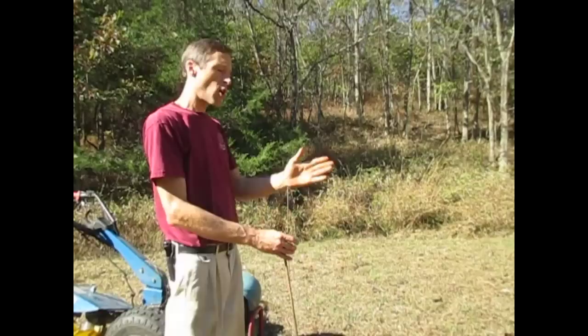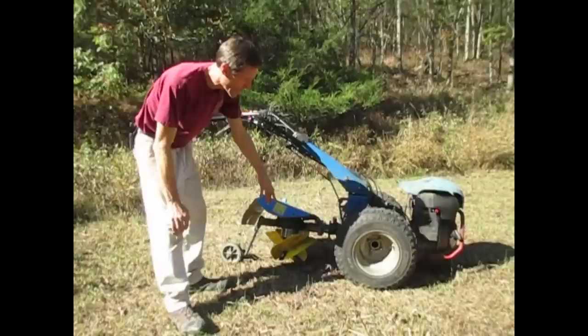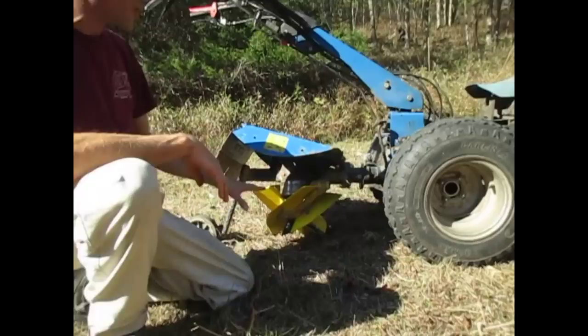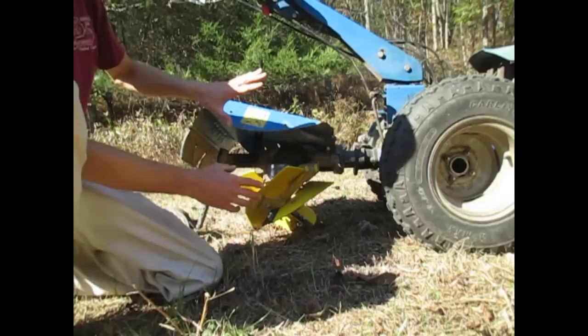because this is a single rotary plow. That is, pan back over here, this is the single version of the plow, meaning there's a single plow head on this thing and it only discharges the soil to the right. There's also a double-headed version of the rotary plow, which we call a swivel plow, or some people call it a reversible plow, which has two plow heads, one above the other, and one turns right and one turns left. This version of the plow only discharges soil to the right.